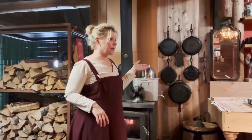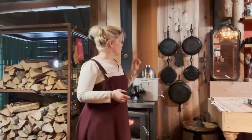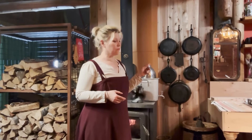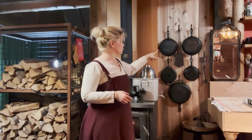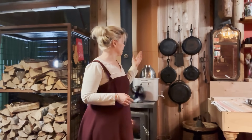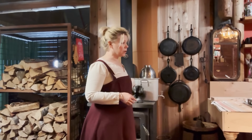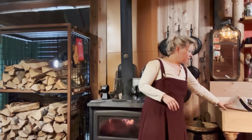That is the first thing I've done in this cabin that I think actually looks true to how I picture this cabin — like a cabin. I know everything else I do looks a little bit over the top, but this is the true rustic feel and look that I was going for. The wall is framed out with 2x4 construction on the back, and where each of these hooks is placed is where one of those 2x4 studs is, so I don't have to worry about the wall bowing or those hooks coming loose. Now all my cast iron is positioned between where I'm cooking and where I'm prepping my food. In a future video I'll show you the finished kitchen, but right now it's still unfinished — I'm still working on the counter, and I'll explain why in an upcoming video.